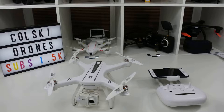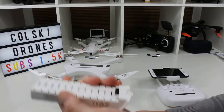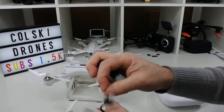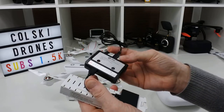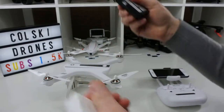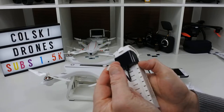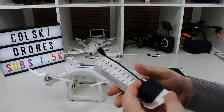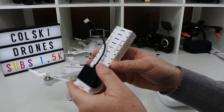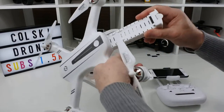Let me talk about the battery charger. This is the charger you get with it — it plugs into your battery exactly the same way the Bug 3 Pro works, and this plugs into a USB. It's going to take between 5 and 7 hours to charge. I do not recommend using this method. What I recommend is using the balance port connector and buying a B3 charger, which charges 2S and 3S batteries through their balance ports — it'll take half the time. They're about 5 or 6 quid and you can get them everywhere. I'll put the link in Amazon when I put the drone link in. It's a much better way of doing it because you're not going to be waiting 7 hours to charge.